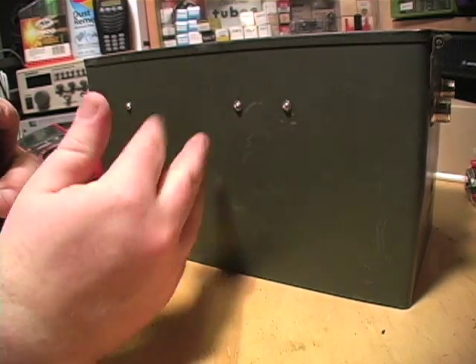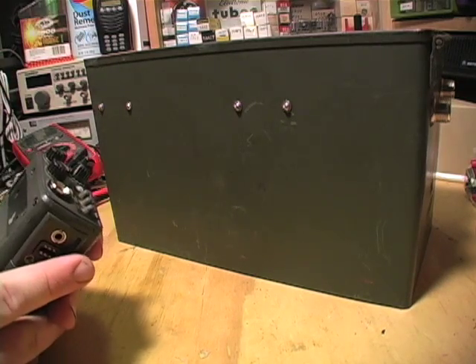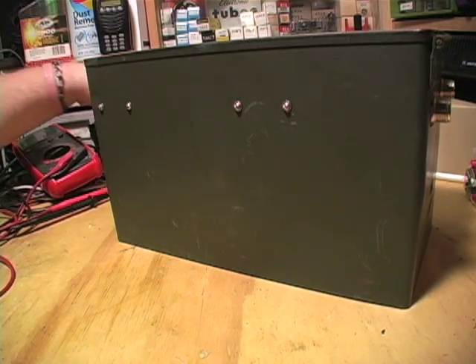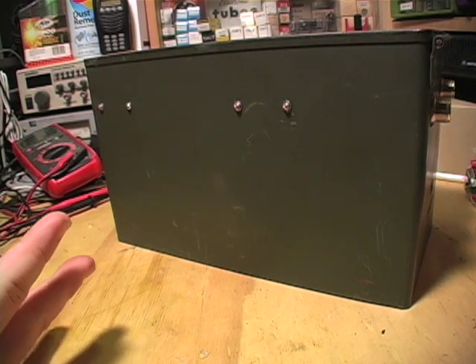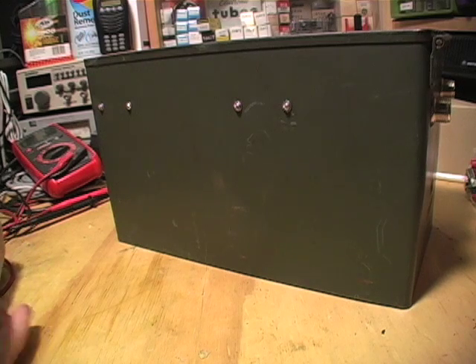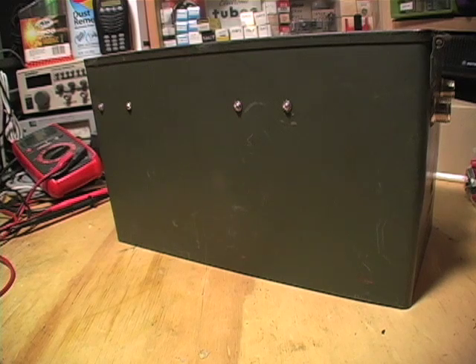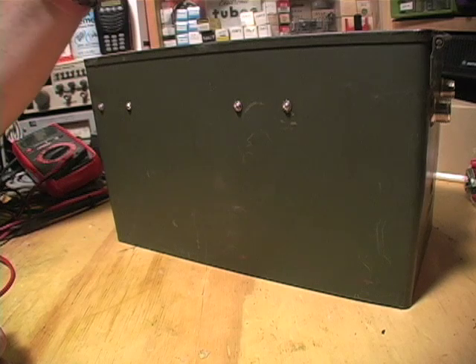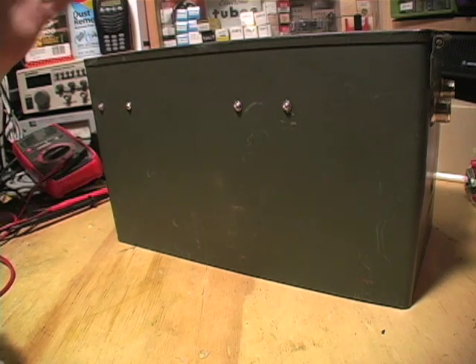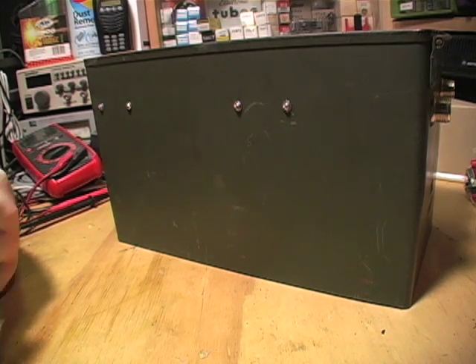I was going to take this up to Northern California, throw it around — I want it to be able to fall down a hill and not damage the radio. The plans for how and where you actually wire in what will be linked below. It's about three wires to harness these together, and boom — you have transmit and receive and you don't need a control module, which is great. What that does mean is the repeater will not ID, it will not hold and have a courtesy tone, it won't announce the repeater callsign or do anything fancy like that, but you'll have a functioning repeater.